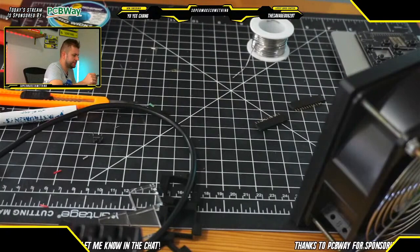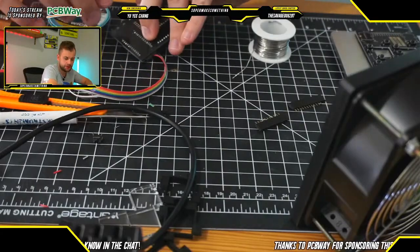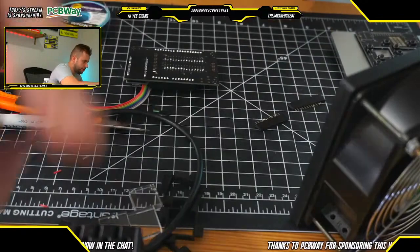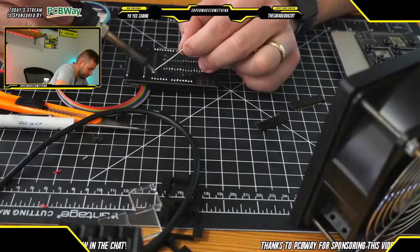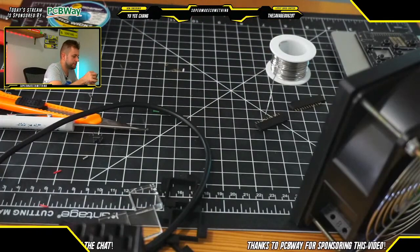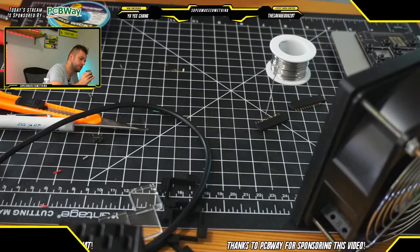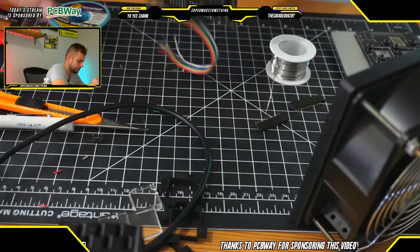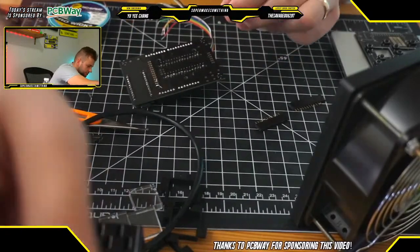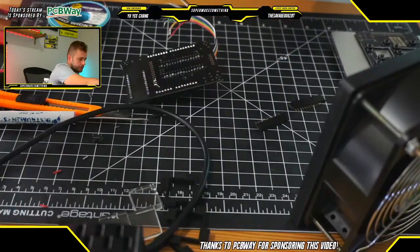One note here. This ribbon cable will basically flex along the length of the Stream Deck, and there are several different types of wires that you can buy. Either solid core or stranded core, where you have individual strands of wire running through each of these colored leads. My recommendation would definitely be to buy stranded wire, because these will flex through the Stream Deck a little bit, and having that extra flexibility just makes everything a little bit more robust. Soldering that on here.